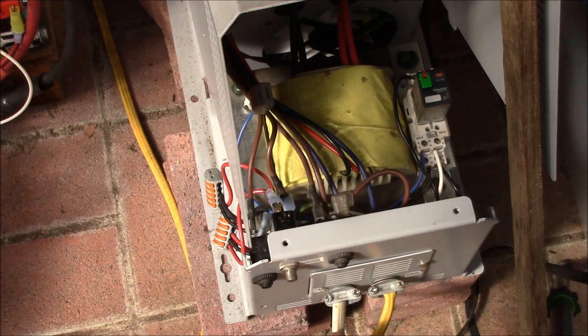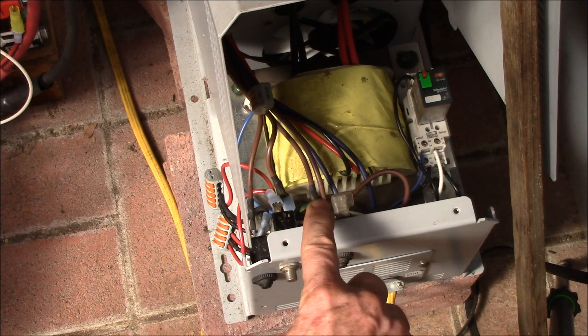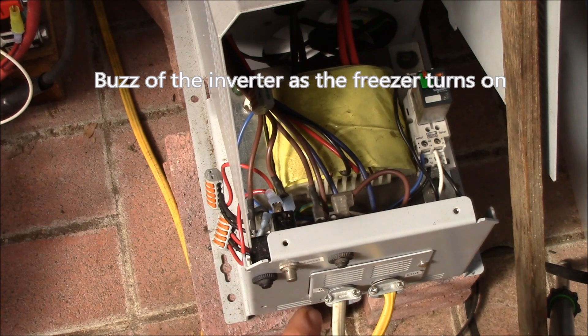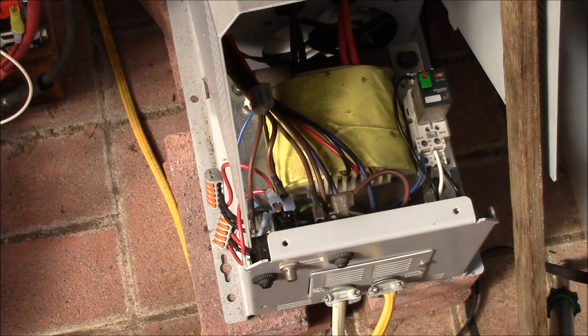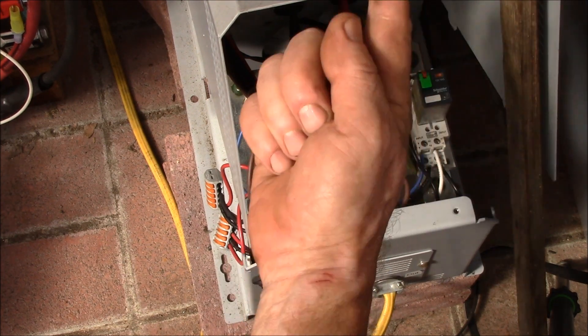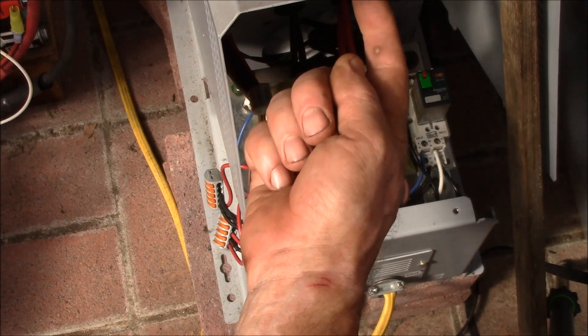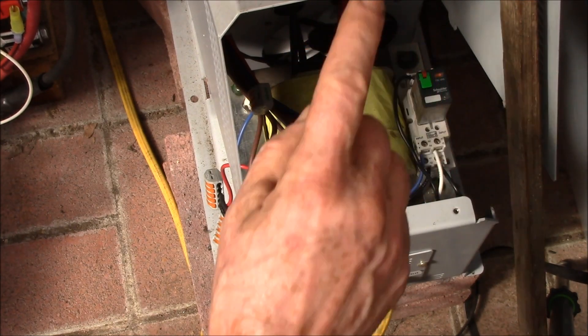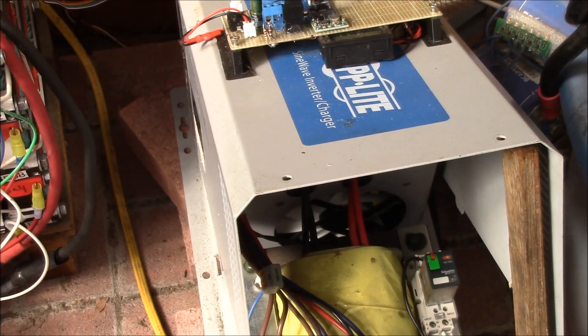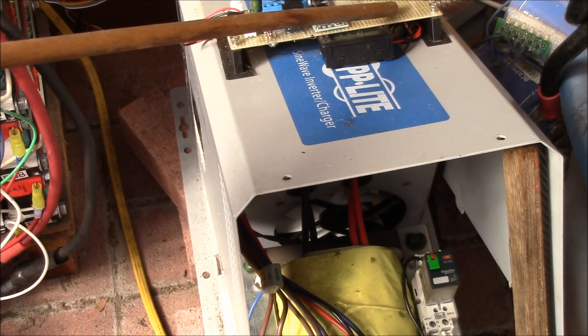What I need to know is when the AC power comes back, because I'll want to switch back to AC power. Right there my freezer kicked on — there was a little buzz when it picked up the freezer load and we're now pulling 210 watts. I'll probably drill a second hole in the cover and run my 120-volt AC signals through one hole and all of the low-voltage DC signals through the other hole, just to keep the low voltage and high voltage separated.